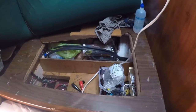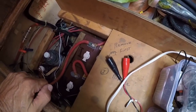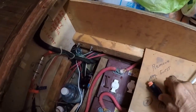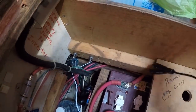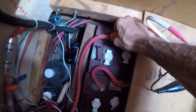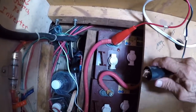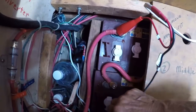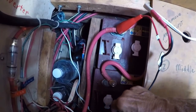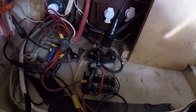We'll go down and make the electrical hookups to get things going. In the battery bank we have six Trojan T105 — they're a six-volt battery, all set up to put out 12 volts. We'll put on the red connection first, put that right directly to the battery, make sure it's a good solid contact. And the negative — negative goes on last and is also the first one to come off. Good solid contact. Okay, we are good to go.